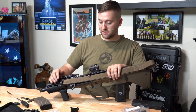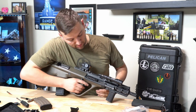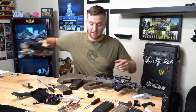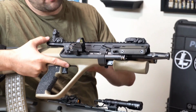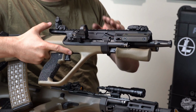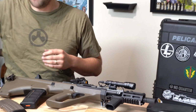For the A3 M1s, because the M1 has the receiver hump in their castings, which you can see here, the Midwest has to kind of jog around that hump. The A3 M1 rail is going to be as low as the SA rail, but it's going to make a slight rise over that hump to get over it to remain structurally sound, and then come back down to continue the pick rail at the same plane of reference.